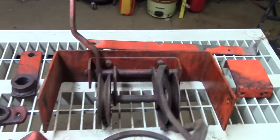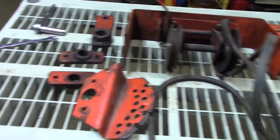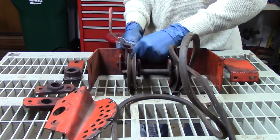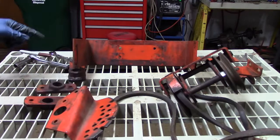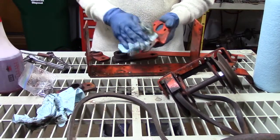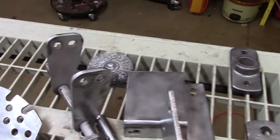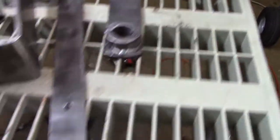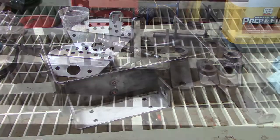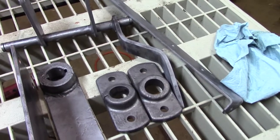What I'm going to do today is work on some various parts — this is the belt part on the front. Get it apart, got some various parts here. Just put them in the sandblaster, get them all cleaned up, maybe the wire wheel across them, and then some phosphoric acid. And this is what you get after wire wheeling, sandblasting, and then wire wheeling again — a lot of clean shiny metal. Now the phosphoric acid. You've got to admit, that's a good-looking bunch of metal — all ready with the phosphoric acid and ready for paint.